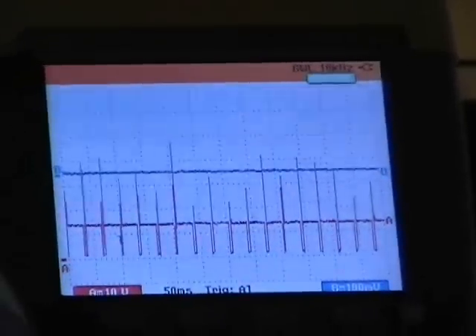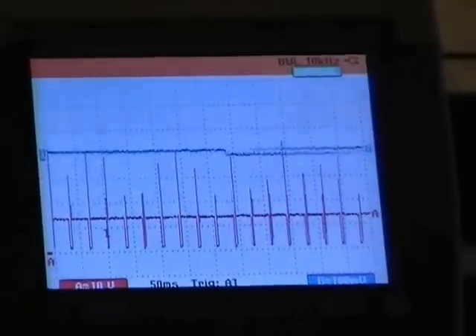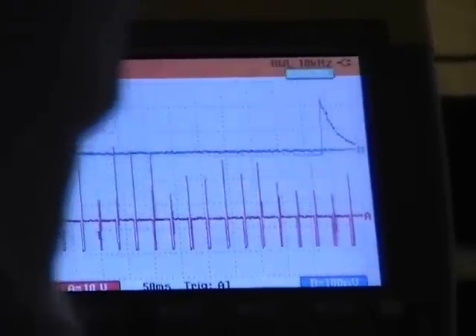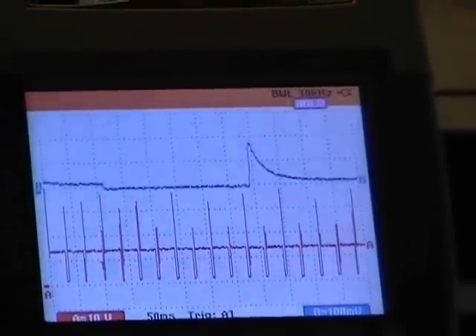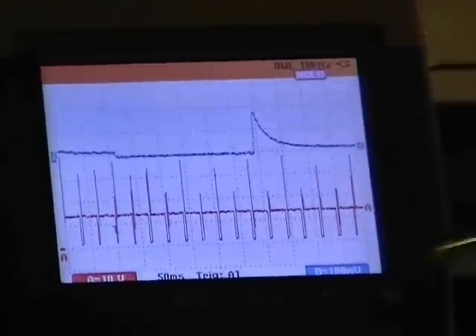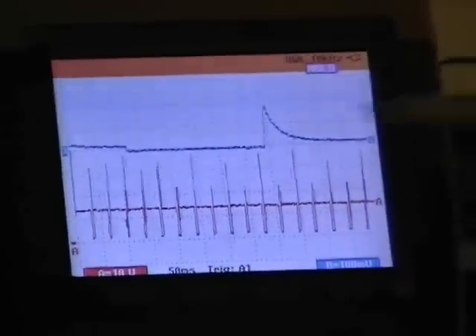So this particular motor — that's zero. Let me shut this noise maker off. Now that particular motor right here, if I look at my amperage — if this is zero, my amperage went up one amp. One point nine or so amps, because I'm almost at the two amp box. Every hundred millivolts equals one amp. So that'd be one amp, two amps, three amps — we're real close to one point nine amps.